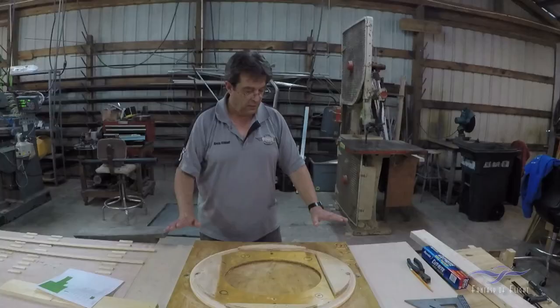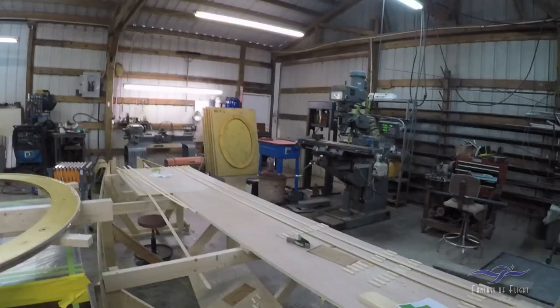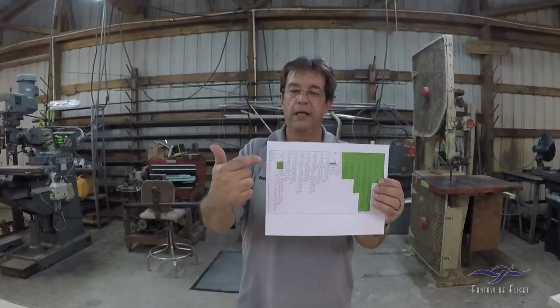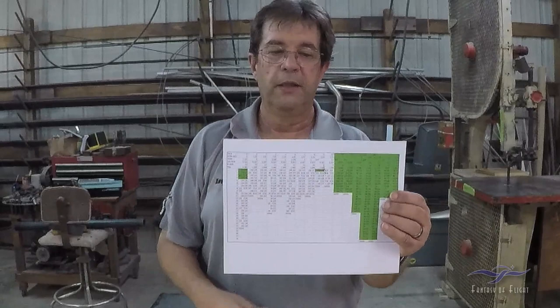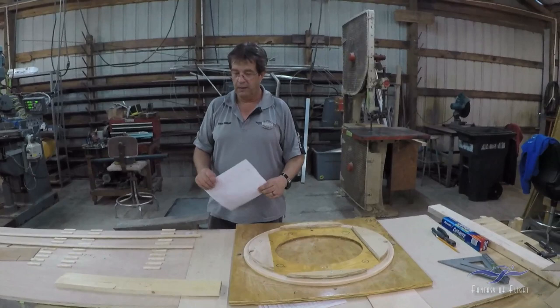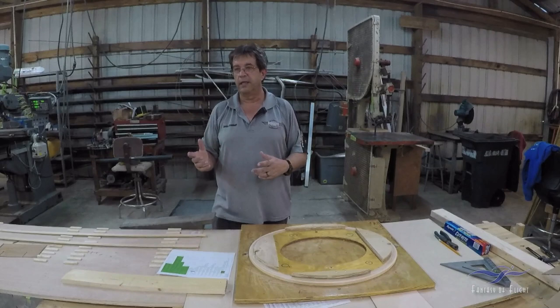Each of the 16 diaphragms goes back on its plate. You can see number eight in the distance with a whole stack of tooling behind it — that's the tooling just to make them. We've calculated all the strip lengths and have it organized by diaphragm number: the laminations, exact lengths to cut. Everything in green is completed; what's still being worked on is shown on the other side. It covers diaphragms one through 15 with all the detailed info — thickness, width, number of laminations, and length. We've done all this math ahead of time so production can continue each layer. Cal tries to get one layer on three diaphragms at a time in a given morning or afternoon, then repeat the next day.